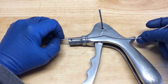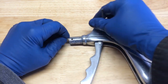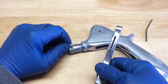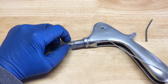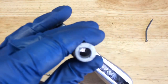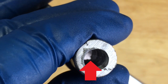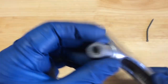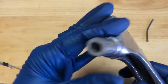I'll drill a hole in the back here and loop the wire so I can pull it to adjust the tension. I need to drill a hole through this groove — the cable fits in there because that's where it was, so I'll use about that same diameter drill bit. This is just aluminum, so it'll be easy to drill. I did notice where the cable was riding it took a little bite out of the aluminum there, which is obviously not good for the cable and will wear it out. I'll check for a plastic bushing that'll fit in there.